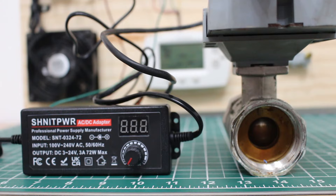To the left I have my DC power supply, and to the right we can see the inside of our valve. Once we energize our transformer, 24 volts AC gets sent to red and black — our negative and positive on our actuator — which forces the valve into its normal position. These can be configured at the supply shop or manufacturer for either normally closed or normally open. This one is normally closed, so when we don't have any DC input the valve will be closed, as it is now. We have 24 volts AC but no DC voltage, so we are fully closed.